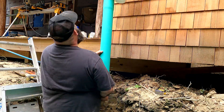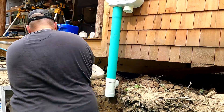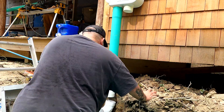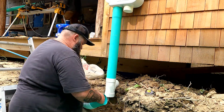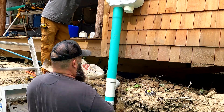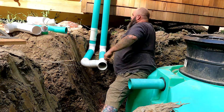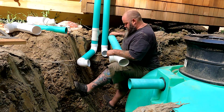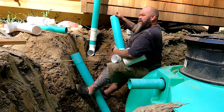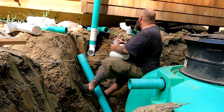I've got a T on the left outlet coming out of the pre-filter. That's so that the gutter on the back of the building can come down a downspout and then turn back under the house to tap into this four-inch run where that T is. I'm hoping to get both the front and the back of the house, and I think it's not too much for this four-inch pipe to handle — it's a pretty small roof and small cabin.